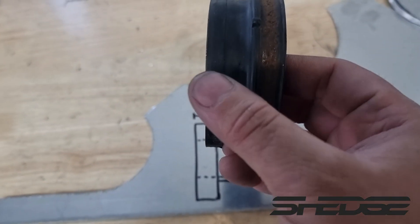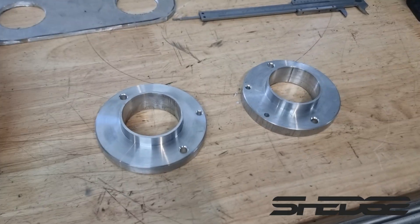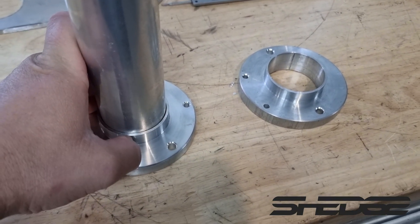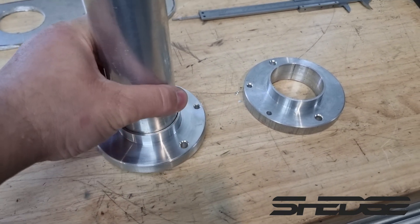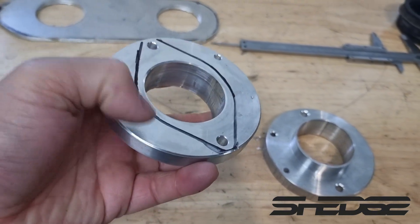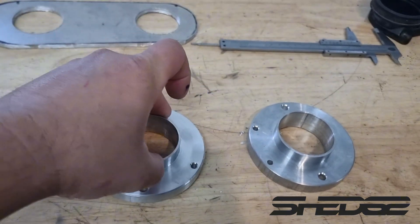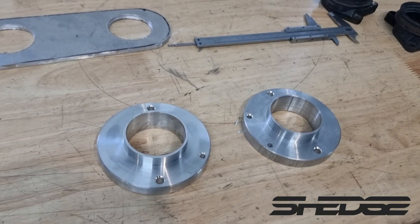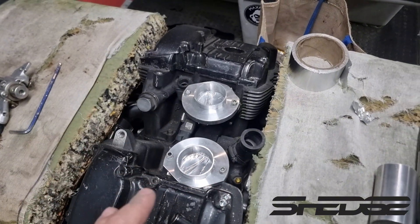Imagine this flange sitting like this with the bolt running through the center there. Here we have it - from drawing to reality. It's going to be a lot easier to weld this two-mil step to the two-mil tube instead of going 12.5mm to two-mil. What we need to do now is shape it out - I'll cut a little bit off to a minimum because I want to keep as much material as possible as a heat sink in these flanges to save distortion. We'll trim a bit off, put them on the block, see where they're sitting, and then start tacking the whole system up.